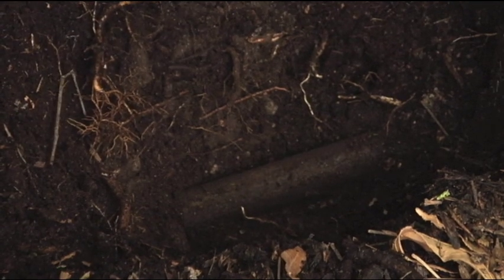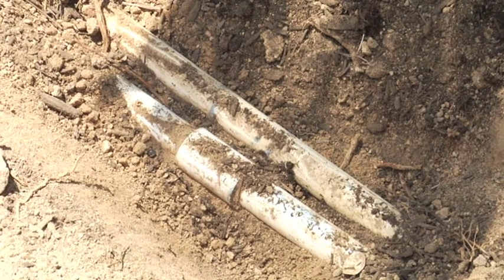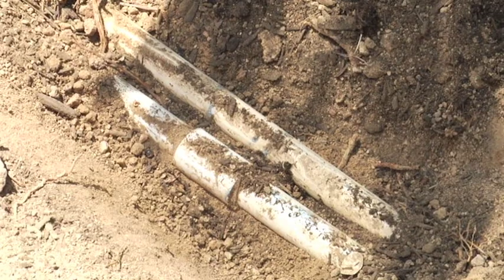Unfortunately, a lot of irrigation lines, especially landscape irrigation lines, are run in PVC plastic. Our metal detector, of course, will not indicate them — we cannot find them with a metal detector. So there's a little extra precaution when it comes to PVC lines: more caution in studying the grid, the layout, the orientation and position of sprinkler heads. It may be that you just have to go through with your flags and mark all of the sprinkler heads — all the rain birds — that are present. Those will begin to show a grid pattern of the irrigation system, and many times that's enough to tell you where those lines run.